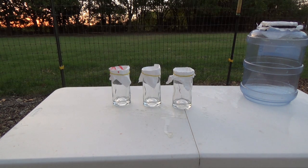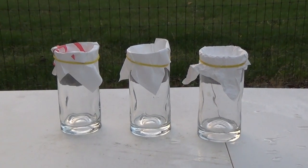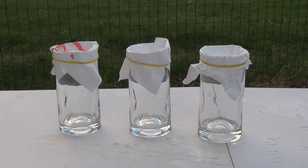So what I did before I went to work this morning, I cut three pieces of Tyvek. The one on your left is Tyvek with the logo outward. The one in the middle is Tyvek with the logo inward. And the one on the right is what I call pre-conditioned Tyvek, which means I have soaked it in water and wringed it out and wrinkled it and made it nice and soft. Some people seem to think that has a difference in the water repellent properties.